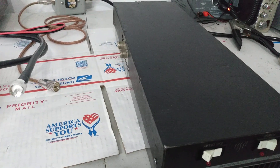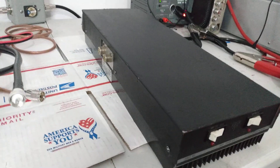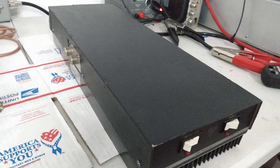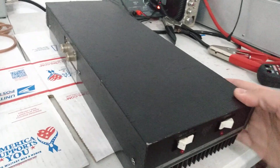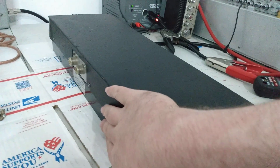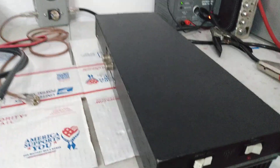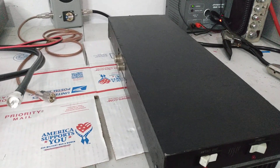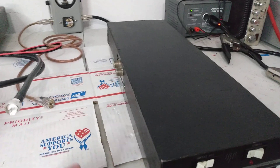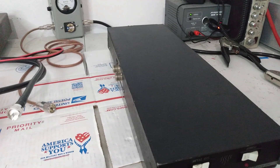It was doing 800 watts with a 50-watt radio hitting it, so it was doing what I would expect. I was pretty happy with it as far as the output goes. But obviously the durability wasn't there, and it wasn't even hot — this just happened a couple of minutes ago and it's barely warm to the touch. I didn't stay on it very long either. The voltage at failure was 14.5, so it wasn't being overvolted. But I saw that clamp meter drawing crazy power and I thought, something is about to give up.